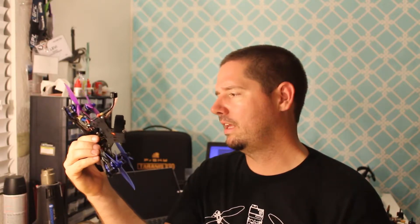I paired these with a Flying Cinema frame, the X20, and Little B 30 amp spring ESCs running D-shot 600. They're not very good ESCs, but they have big FETs and can handle the high current I thought these might draw. I got out with Calvin from Newbie Drone to give this a shot — I had just built it, did no tuning, and flew it around. The first time I flew it, I thought 'meh.' I thought my Storm motors were just as powerful and just as quick. It just didn't feel any faster than anything I'd flown previously. So I kind of chalked it up to: they're useless, there's no point for them. At 3000 KV, you're not going to get it out of them or even close. So I put it on the shelf for a few days.